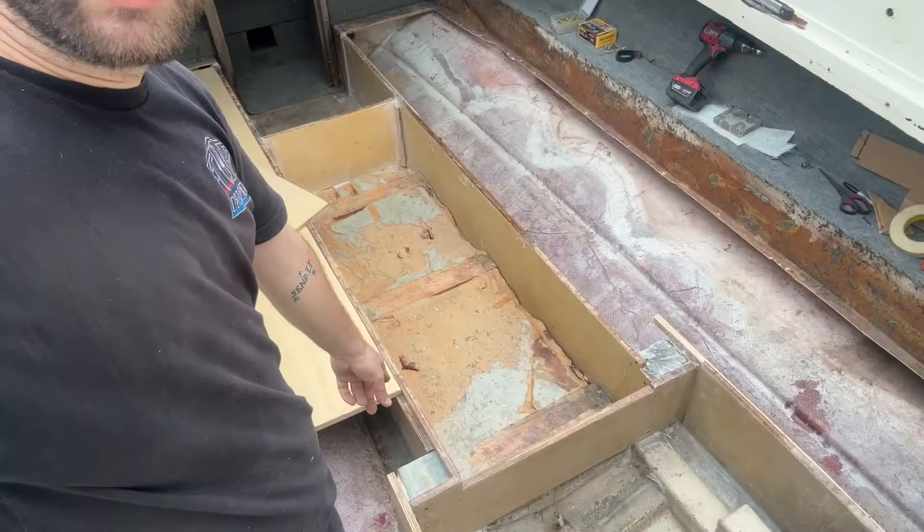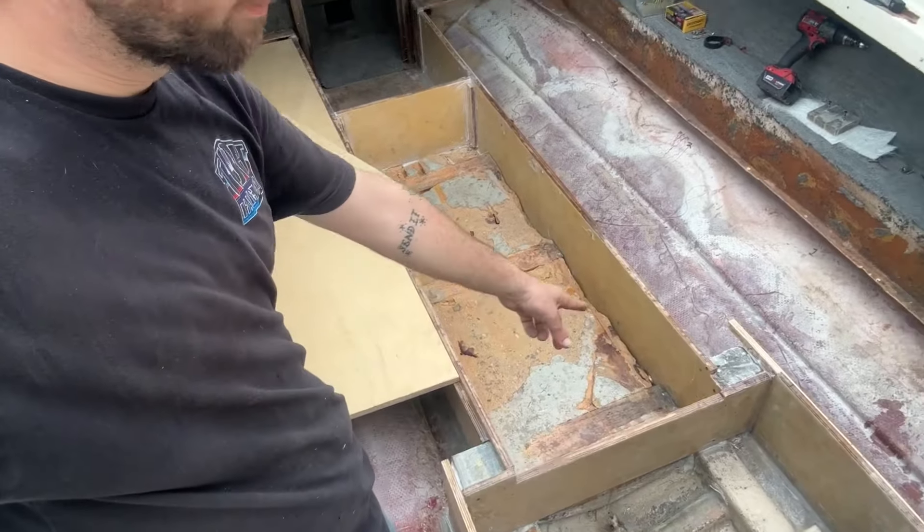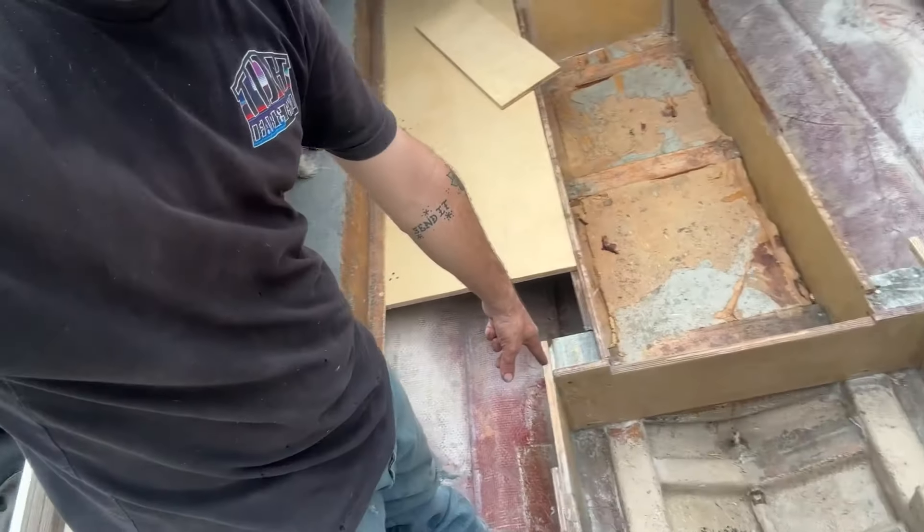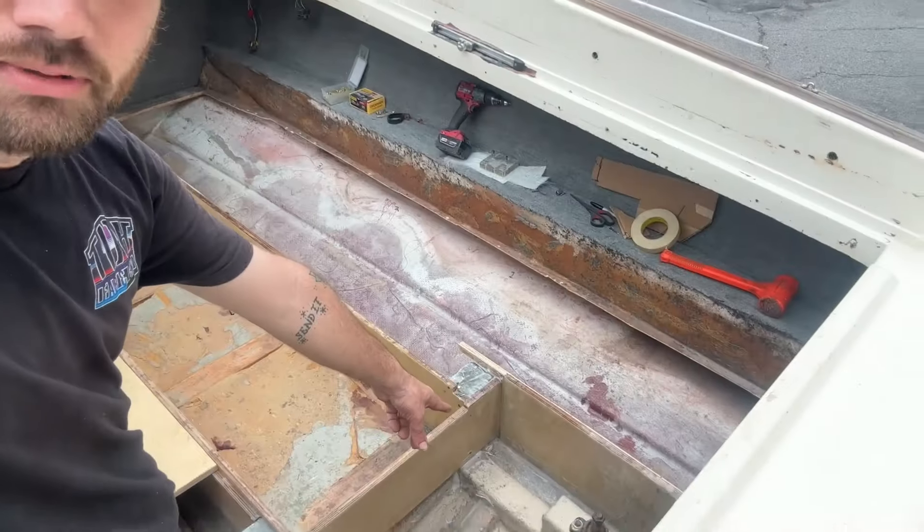I'm going to show you what it currently looks like right now. I'll throw a picture in of the rough mock-up of the floors. I got the entire starboard side done for the floor. There's one little section that I had to cut out a new piece to refit, so you guys will see a two or three inch space between the rear board and the front board. But I got the bulkhead back in there, got those large bulkhead blocks — that's what basically supports the bulkhead to the bilge wall. I got a new build side here and a new build side there.